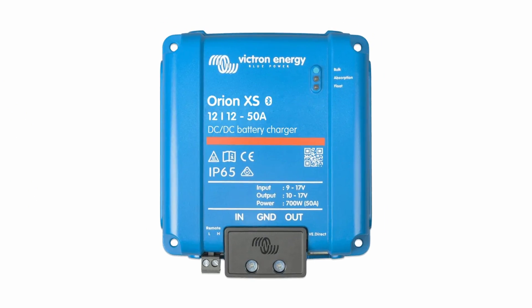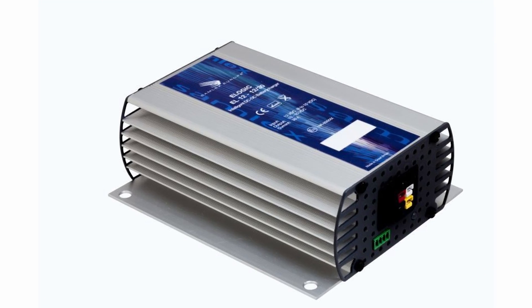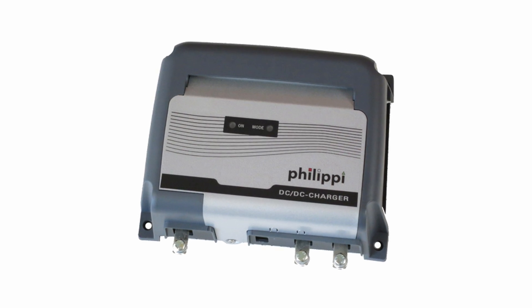We've got now in the marketplace these battery-to-battery chargers, which are fairly new — we haven't had them for more than five, maybe ten years. It's basically a DC-to-DC converter between two batteries, except that it's got smarts built in at least one end, where you can have a battery charging algorithm which you can program for lead-acid, AGM, wet-cell, lithium-ion, or whatever you want. So that works really well.